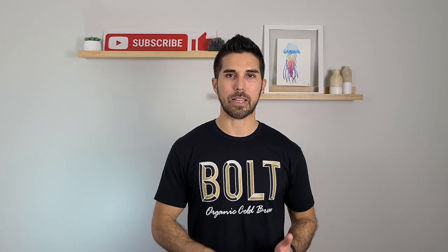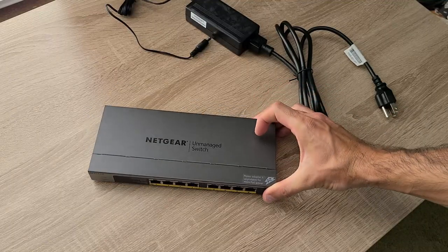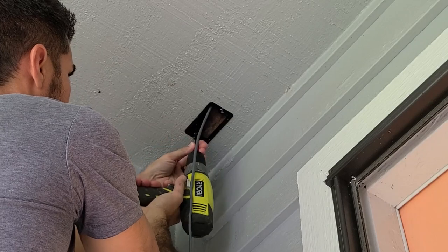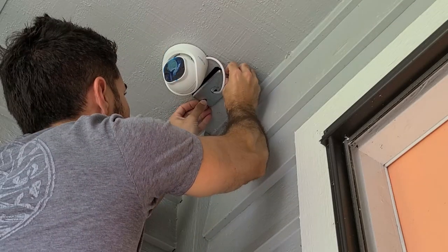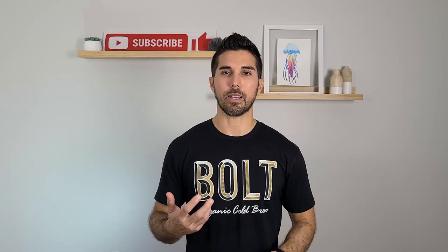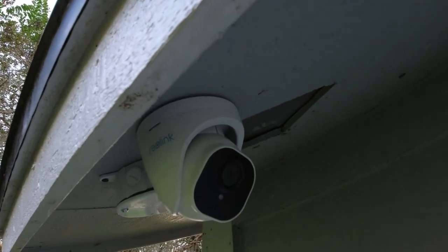Once I phase out the Night Owl, I'll redo my network closet — probably put in a patch panel with patch cables going to the PoE switch and clean it up, make it look really nice and neat. Next, depending on where the cameras end up going, you either want to install a low voltage ring or some type of surface mount box. In the ceiling area of the front porch there was plenty of room, so I used a low voltage ring and face plate, which I'll paint eventually. For one camera I used a surface mount box because I didn't want to cut a really large hole in the eave. Once the cameras were mounted, I used the app to position them.